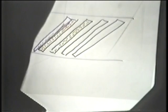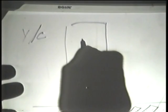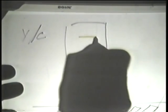Yeah. Okay, the reason is that when the comb filter is used to separate Y and chroma, the chroma is delayed in the process going through the comb filter. And it can be delayed at least one line, sometimes two lines. So if you have a picture, something with, like, a window, and this is the chroma, and it's being processed by the comb filter, the Y information will be in one position, and the chroma will be displaced by, say, one line.